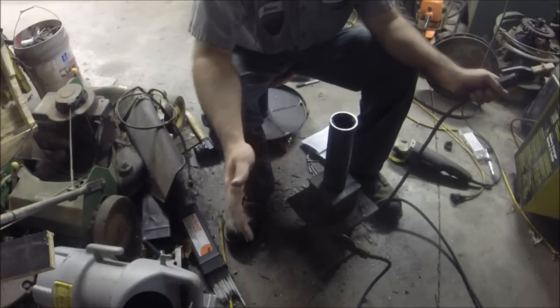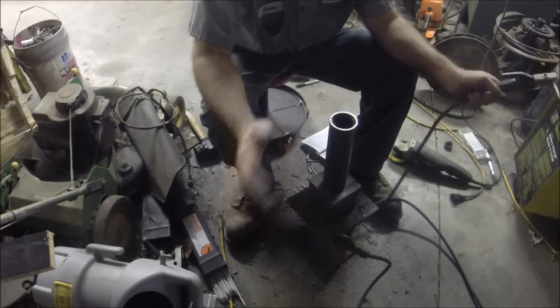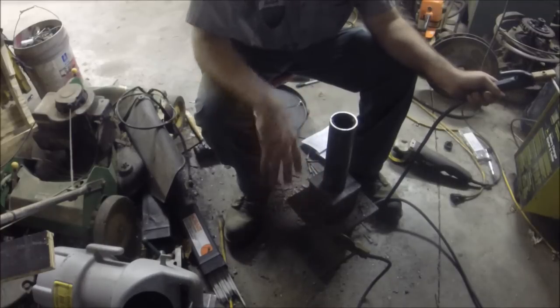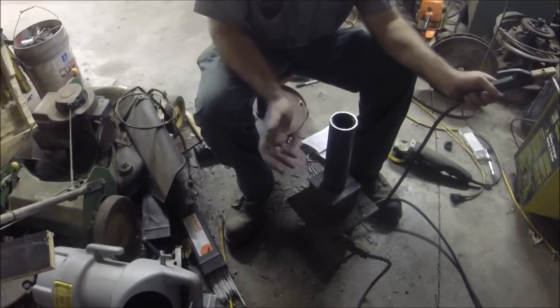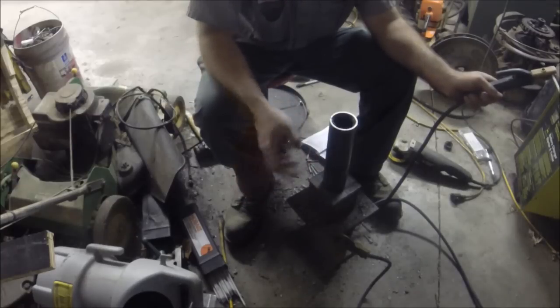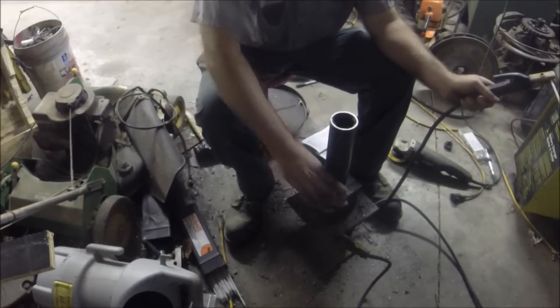It's not hard to pull several thousandths into a machine as big as what the HBM is. You can do a lot of straightening and aligning with the leveling screws, more so than you can on a smaller machine. But since this is down in the concrete, there's going to be a plate inside pulling up. It doesn't need to be fully welded — it just needs to not fall apart.